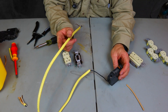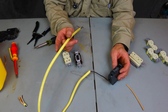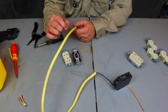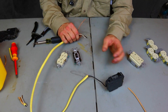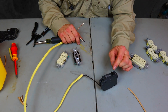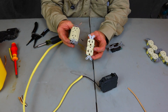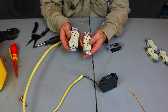Don't get confused if you see white Romex in your panel — they used to make white 12, white 14, white 10, even white 8. You need to check, because the gauge is written on the wire. Now, if you're running just one single outlet off this 20 amp breaker, you have to go with a 20 amp duplex receptacle. Or if it calls for a GFI, you have to go with a 20 amp GFI. Either one works — it doesn't matter.